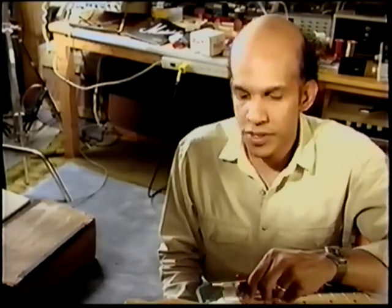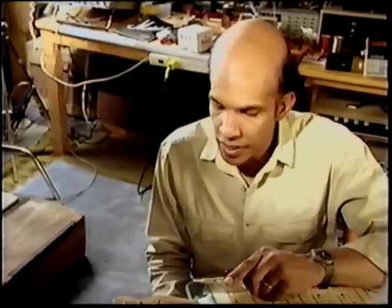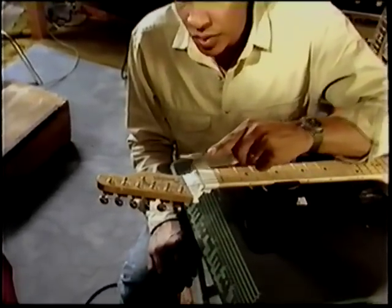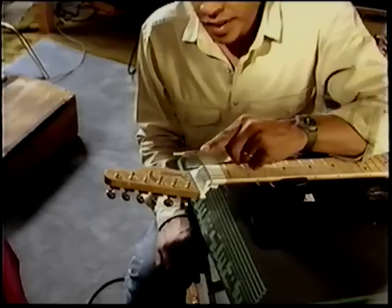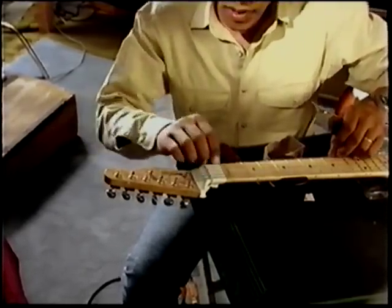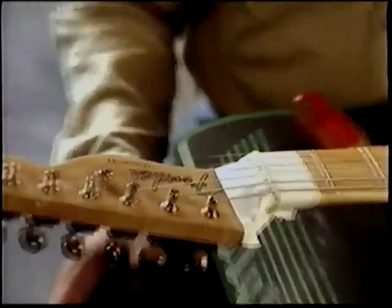By combining crazy glue and baking soda, we were able to come up with a harder surface than the nut itself. Now we're gonna use an X-Acto saw. You can use anything sharp, like a razor blade or even a string. Cut exactly where the old groove was. Take your time. Make sure you leave the tape in there. No more buzz. That's playtime.